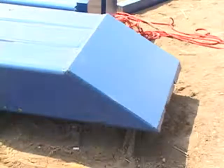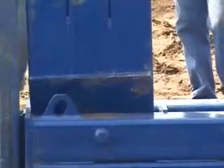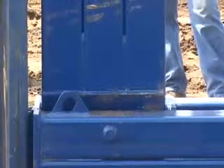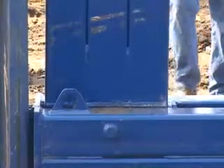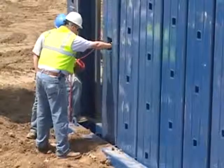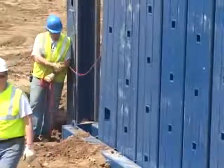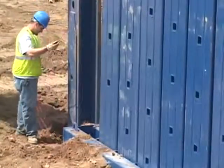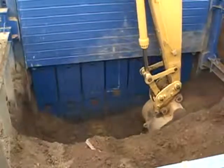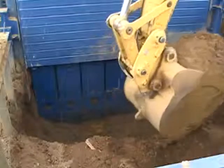The sheeting elements have a beveled edge at the lower end to make installation easier. Lower the elements into the sheeting frame slots. Once all the sheeting elements are in place, continue the installation by undercutting two to three feet deeper than the sheeting frame panel.